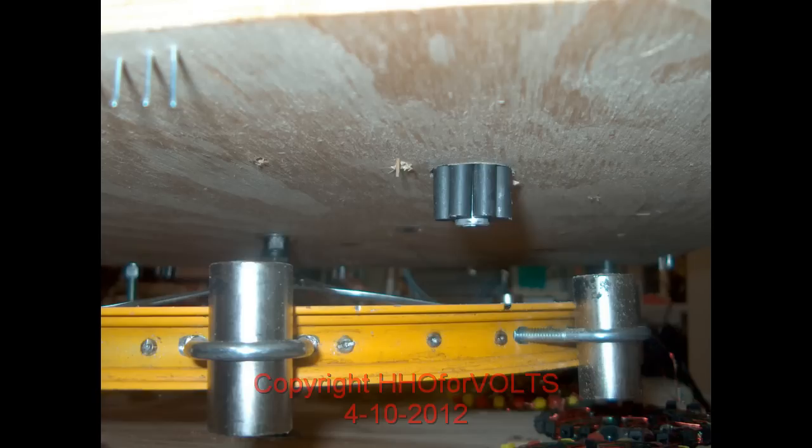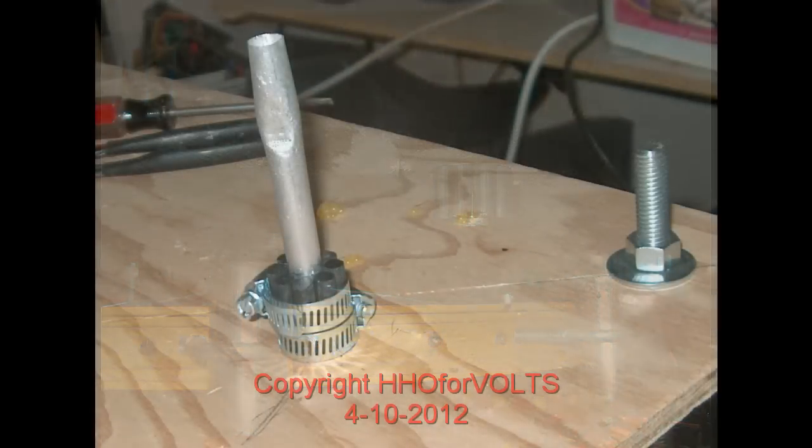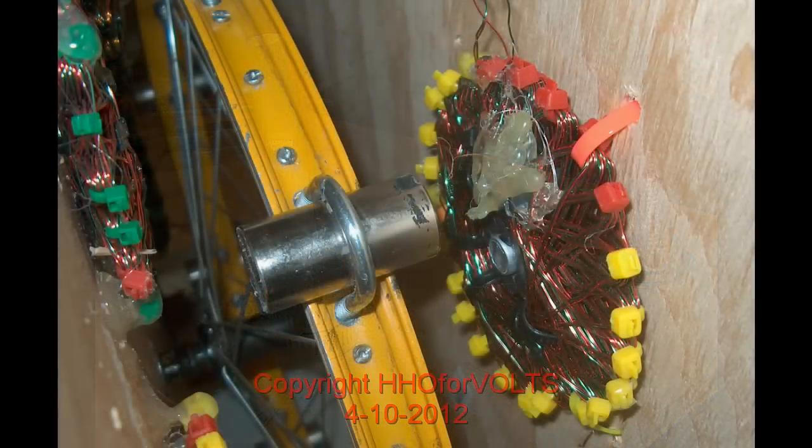Now you can see it slotted through the top. The coil was actually shown mounted, but I just wanted to show you what it looks like in relationship to the magnets on the wheel. This is an absolutely fantastic approach. I can't tell you it's going to work for another coil design, but it will work for the Starship coil. And it's absolutely quiet — when you hear this run, even though it has magnetic ferrite cores, there is no noise whatsoever. The next slide will show it protruding through the coil mounted on the bottom of the top panel.